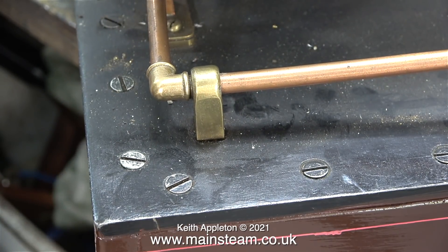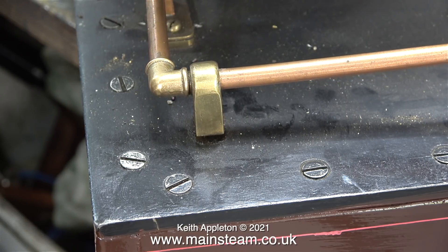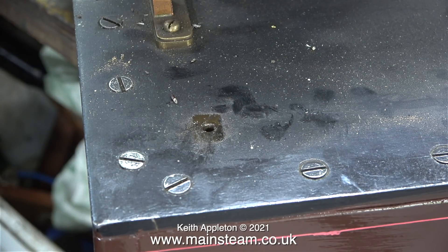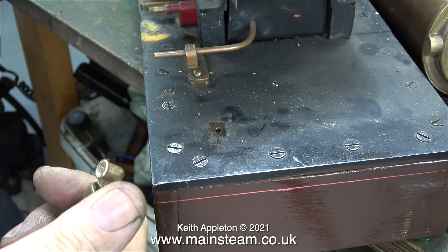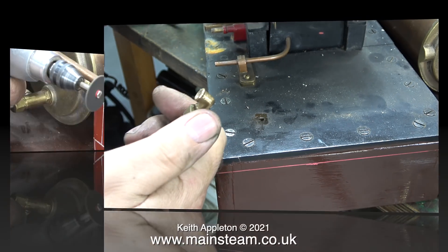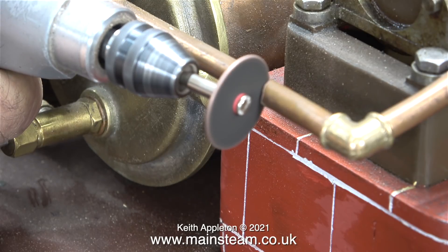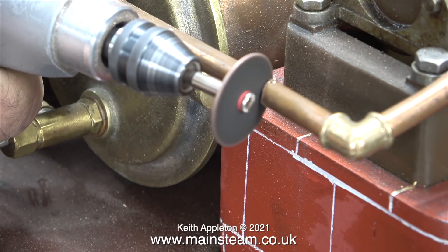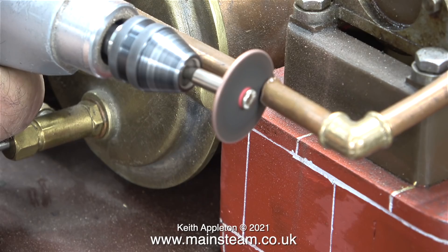When I bought this engine the water and steam piping was done very well, with brackets holding the piping to the baseboard. I added the PM Research cast elbows because I like them. The construction of this steam plant is a little bit bizarre really - look how many countersunk screws are used just to hold the top metal plates onto the wood. To save time, rather than unbolting the exhaust pipe from the engine, I just used a cutting disc in my Proxxon motor tool and chopped it off, being very careful to control the cutter as it broke through the pipe.